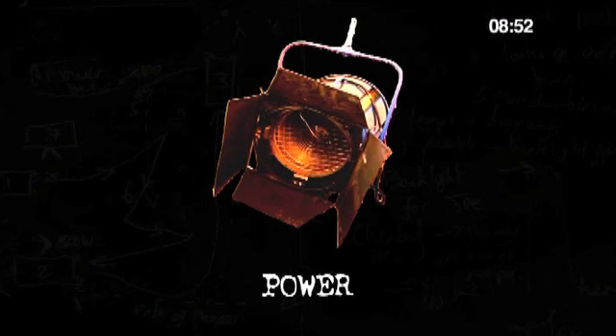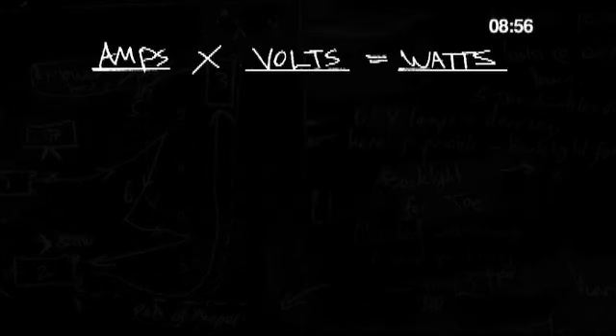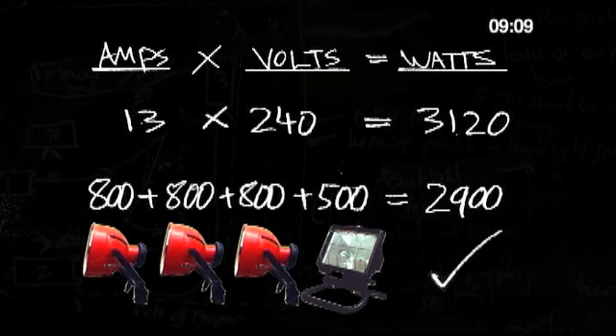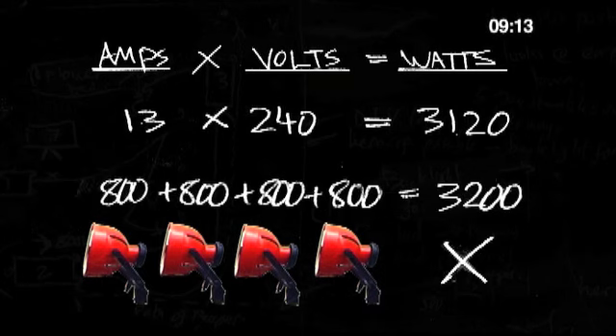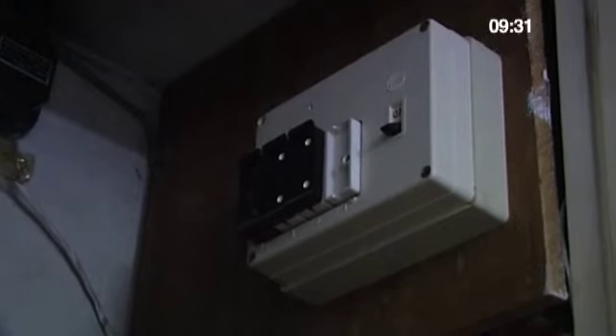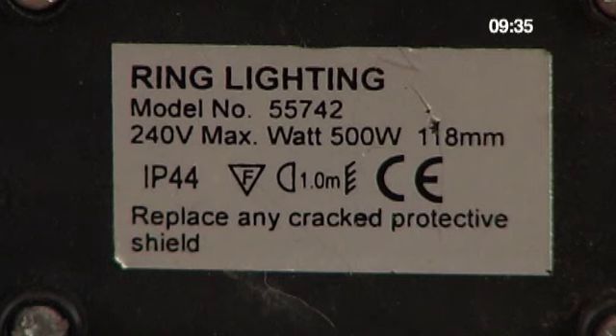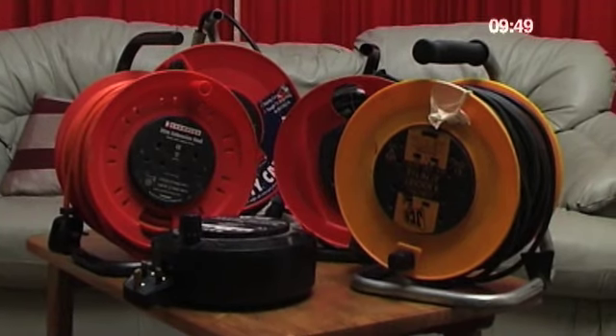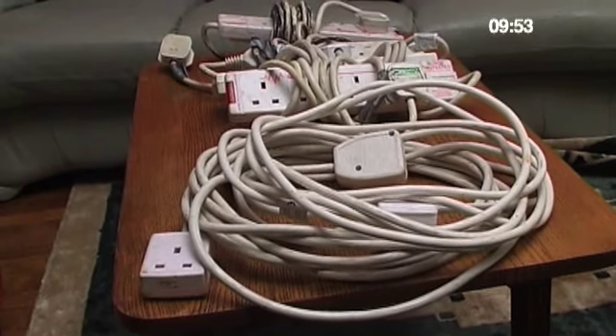One of your chief enemies in lighting on a micro budget is power. Remember your GCSE physics: amps times volts equals watts. An ordinary 13-amp socket on a 240-volt British ring main gives you 3,120 watts, which is enough for three redheads and a DIY lamp. Try plugging in four redheads and something like this will happen — we melted the plug while shooting at Dante's lair and had to gaffer tape it up to finish the night's filming. Check the fuse box of your location beforehand and add up the total wattage of the lamps you want to use. Are you going to blow a fuse? Are you going to have to hire a generator to meet your power requirements? Can you afford to do that? Do you have the right plugs for the generator sockets? My final tip: buy lots and lots of extension leads. It's a law of the universe that you'll always need one more extension lead than you actually have.